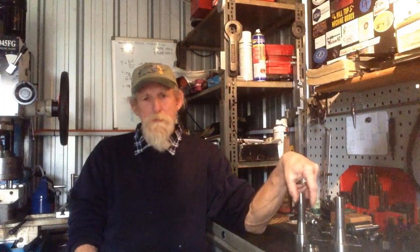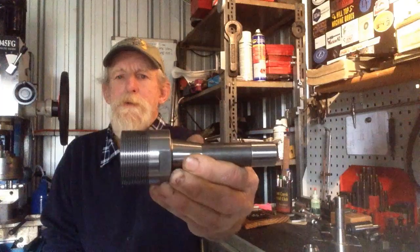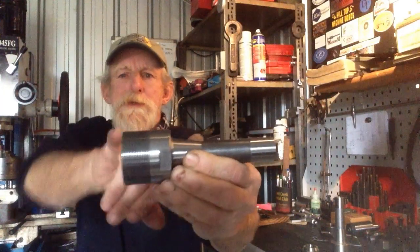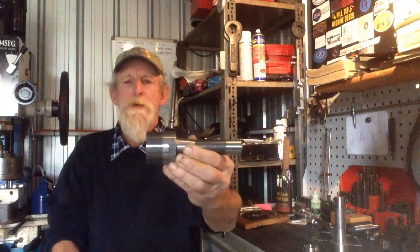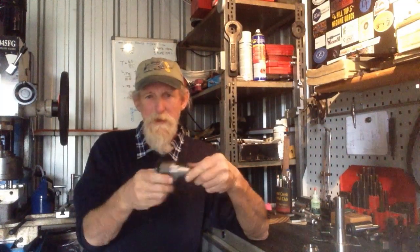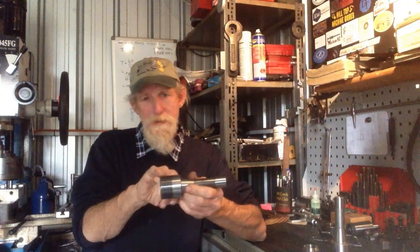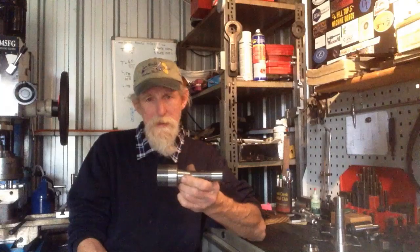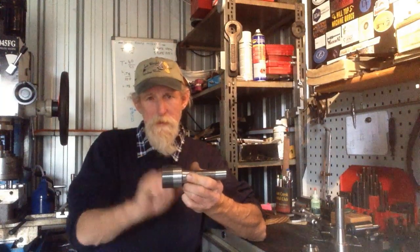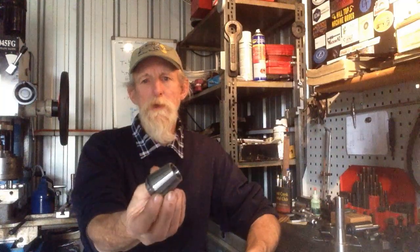So this episode, we're going to complete the thread cutting on the collet chucks. That's an M50 by 1.5 pitch thread. Previously, we've only roughed this thread out down to somewhere near 3/4 of its required diameter. So we'll go through how to chase the thread and pick up, so we're cutting the thread in the right position. Then we're going to move on to setting up for the taper to suit the ER40 collets.